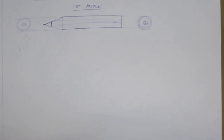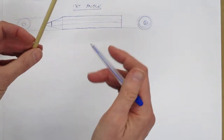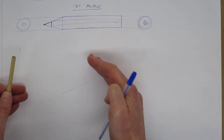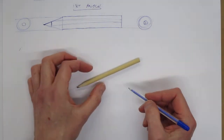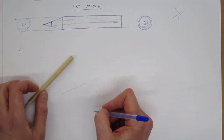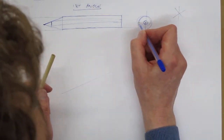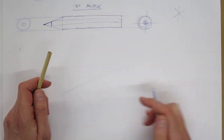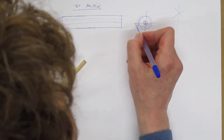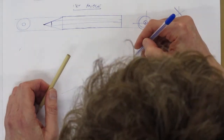When we're drawing something circular we may look at drawing a bounding box, but for this one it's probably simpler if we just draw the center line. I'm going to have a go at doing it in isometric, so we draw the center line. With isometric, remember, everything is at 120 degrees or 60 degrees to each other. At this end of the pencil we're going to draw this profile in isometric — the vertical line will always be vertical, and the horizontal line represents this line here.